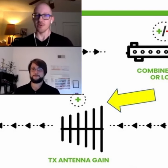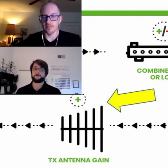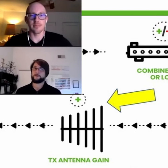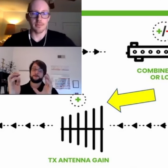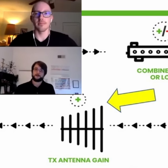Is there ever omni-directional transmit antennas? Omni-directional antennas definitely can be used for IEM, and sometimes it works better when you have a very tight space. You really don't need a huge amount of directional gain, because if you're so tight that you have someone right next to the antenna, they may not have good coverage there.